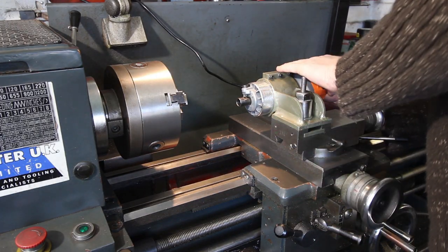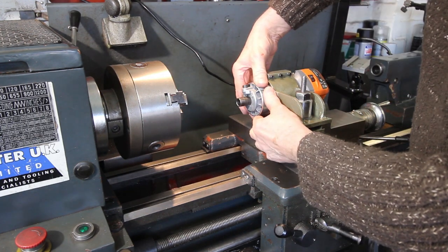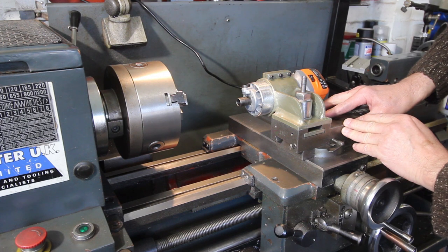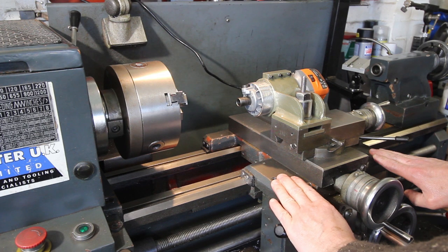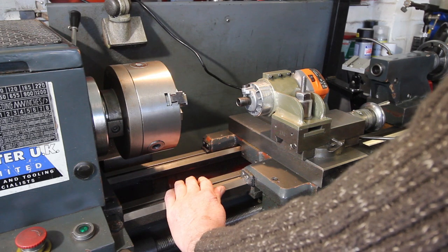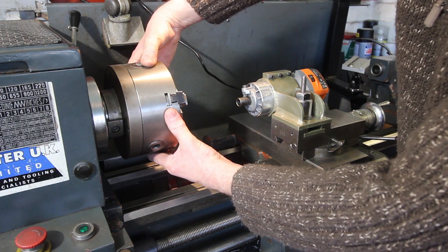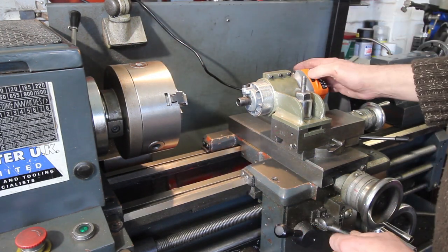Okay, first test, we're on minimum speed. Let's turn it on. There's a little bit of vibration I can feel here. There's a lot less on the top slide, cross slide even less. On the saddle you virtually can't feel it. On the bed, it's almost non-existent. On this chuck, oddly enough, I can feel it more. That's odd, isn't it? Anyway,